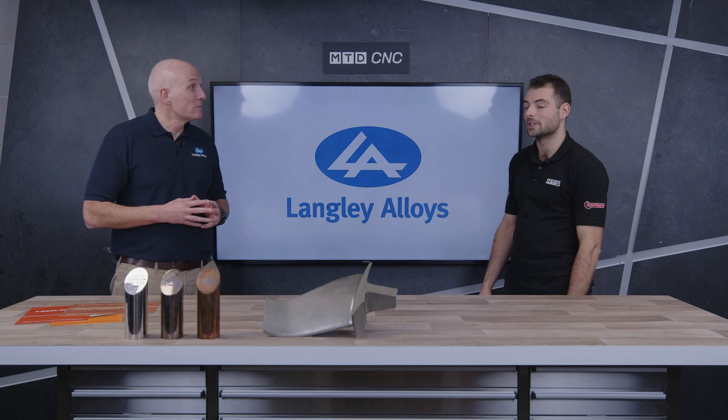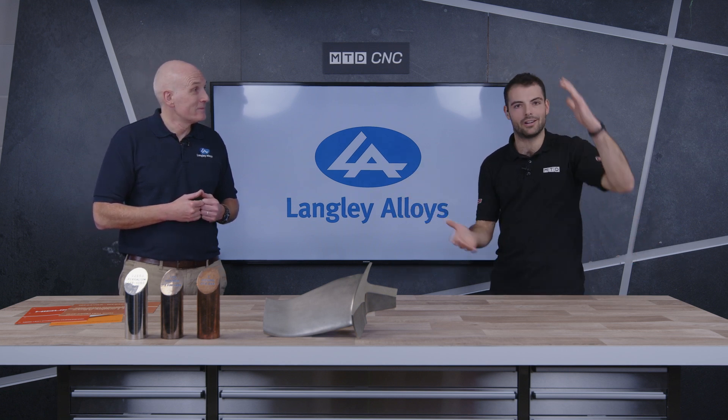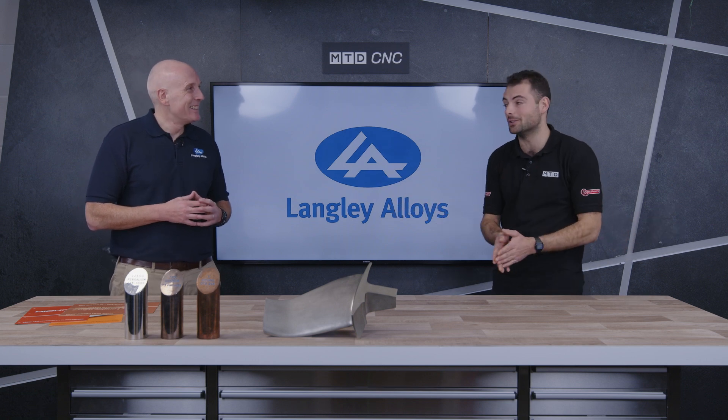Langley Alloys has been the originator of this material and is the stockist to go to. When talking about couplings and connectors, that's smaller diameter bars, which are readily available from stock. It's also used in valve trim and other components — we carry stock up to eight inches. Occasionally a customer will ask for really big blocks, big pieces, and at that size you're talking about having them forged to order — bespoke forgings. Metallurgically speaking, this alloy achieves its strength irrespective of section size, so the only limit is really the application rather than the metal.